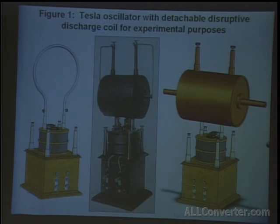Contrary to what might be naturally expected, little trouble was experienced with the contacts, although the current through them was heavy, namely proper conditions of resonance existing. The great flow occurs only when the circuit is closed and no destructive arcs can develop. Originally, I employed platinum and iridium tips, but later replaced them with some of meteorite and finally tungsten. The last have given the best satisfaction, permitting working for hours and days without interruption.